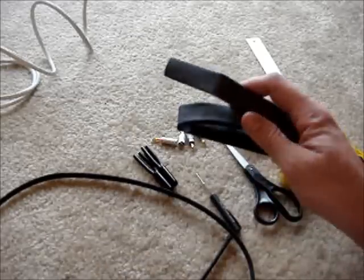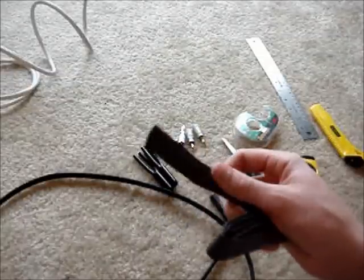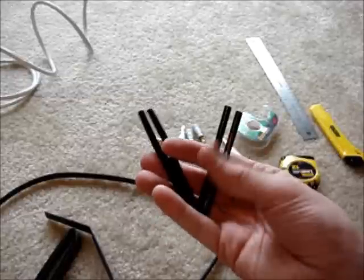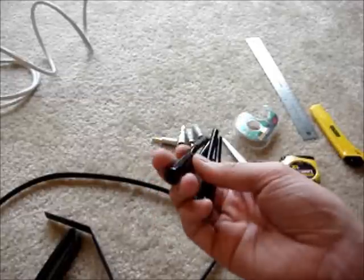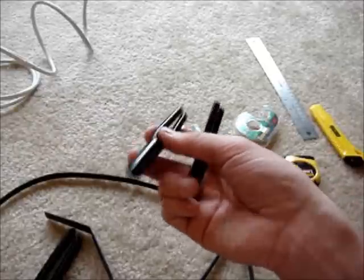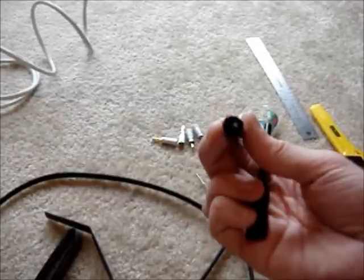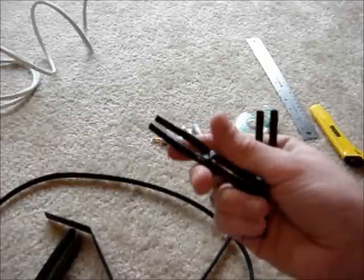This is three-eighths sleeving — I had it hanging around from a larger cable, but you don't necessarily need it that large. I have some half inch three-to-one heat shrink. I like the black heat shrink and I like three-to-one because it shrinks down a little bit better and makes a tighter seal on the end. You're going to need two pairs of cable pants. If you have four conductor cable you can buy four conductor pants. There's a chart on the website showing which entrance and exit size you need for your cable gauge.